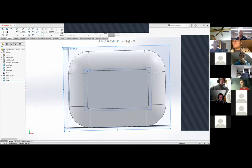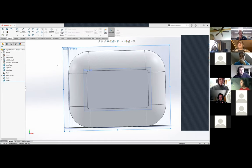So what you could do is, if you just wanted to have a model picture, you could do an intersection curve. So you'd end up putting a plane in, put an intersection curve in, which I haven't gone over, but you just have to Google it. They're not hard to do. And then you'd have to draw like some small cutting rectangle and sweep it around the part to put in that little detail.